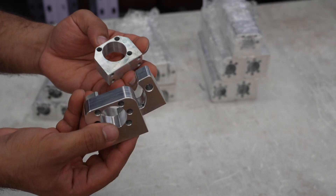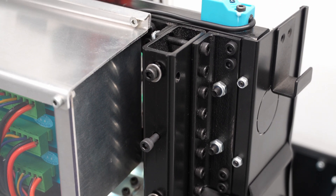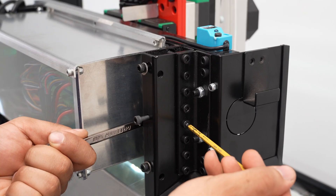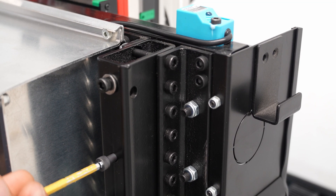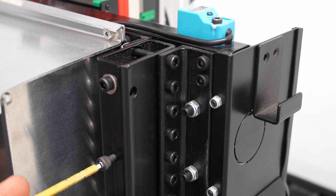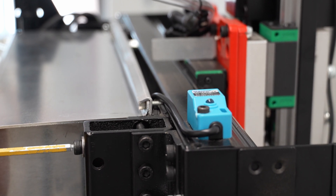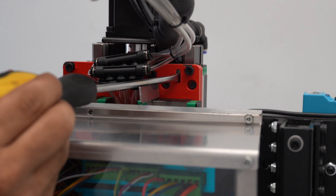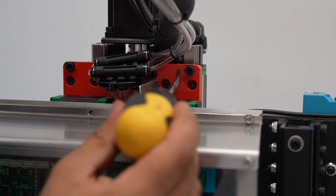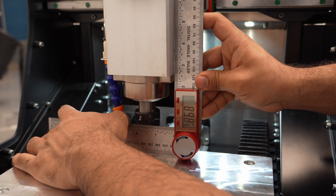What gives the DMC2 Mini its extremely high accuracy in machined parts is that the entire machine is fully able to be trammed and squared after it's built. We've done this by adding points where you can adjust the z-axis rotation, the tilt, the squareness, and the perpendicularity of the x and y axes — so basically every single axis is able to be adjusted relative to one another for a perfectly square machine. I'll have an entirely separate video on tramming and squaring the DMC2 Mini after this, since that itself has its own special process I want to go over in detail.